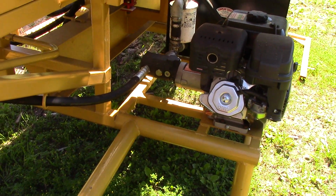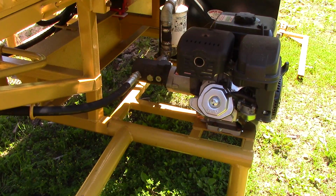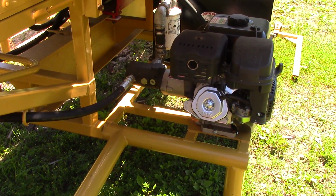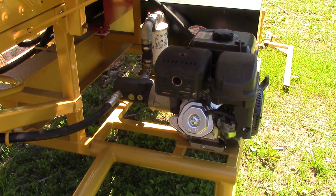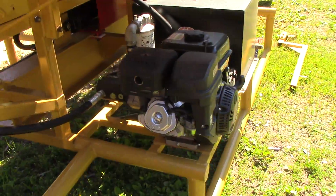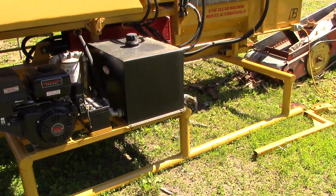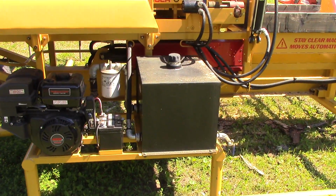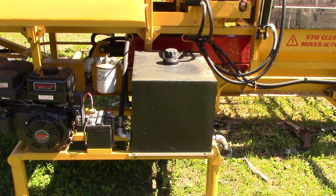Then, unlike some of the professional processors, I just have a chainsaw where I'll cut the log in a traditional way, and then the piece drops down below into the splitter section. Then I have an auto cycling valve to forward the splitting ram, and then it automatically returns.